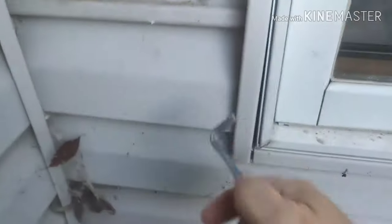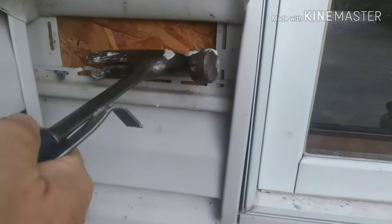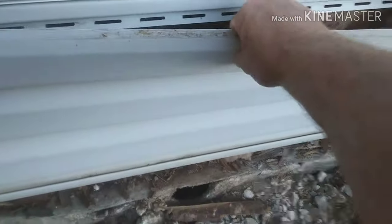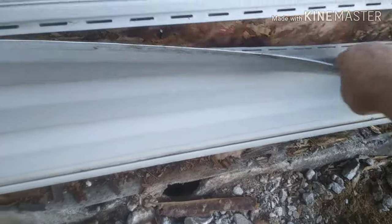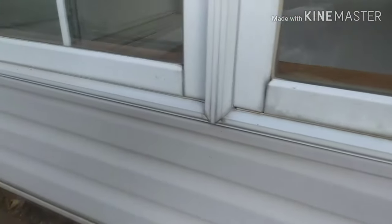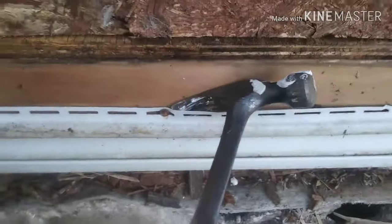Pull the nails out of both sides and give it a good push down to unhook it from the one below it. What I found was they had glued the piece on the cut piece under the window — glued it to the piece below it, mostly because it's a small piece and not a great way to nail it. It looks like construction adhesive, which is probably not a good idea — that could actually melt the siding.